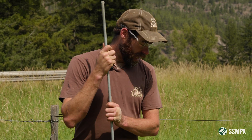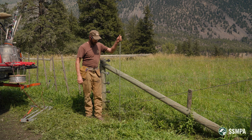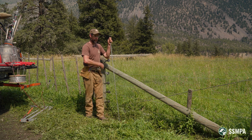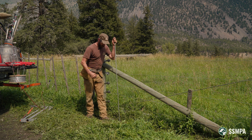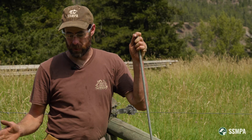In most cases, you're going to have hot wires on your fence and you're going to have ground rods driven into the earth, and those are going to be hooked up electrically back to the ground terminal on your energizer. So when the animal touches the hot wire, the current can flow through the animal, through the ground, back to the ground rod, complete the circuit, and that's when they get the shock.